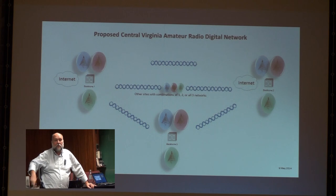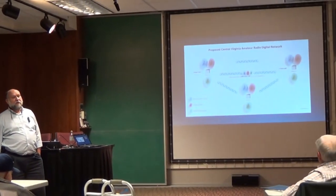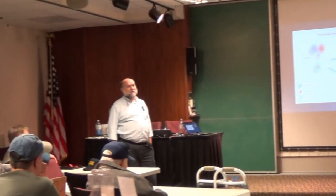So that's a mesh, but operating in the 70 centimeter band, all the way down at the bottom where the amateur TV stuff is in the band plan. And then the WinLink stuff, the 2 meter WinLink station and radio email are a part of this as well. So the idea is to have several different frequency bands with various trade-offs, high bandwidth but limited propagation characteristics up in the microwave frequencies all the way down to what we all know, really good propagation characteristics at 2 meters, but very slow. It's not fast, but you've got connectivity almost everywhere in the county.